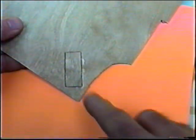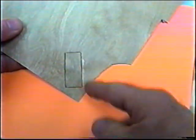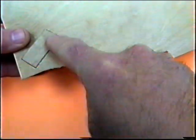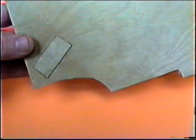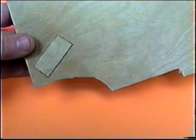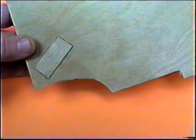Now the easiest way that I like to laminate the plywood is with the grain of each one going in a different direction. Picture 4 different directions. And then each time, once the pattern is made, cut out the part and lay it on with the grain going in the opposite direction. This way you really maximize the strength. You're making a part that's really lightweight and really durable at the same time. If you make this part out of plywood that only has 3 or 4 grain directions, it's not going to be as strong as this, and it's going to be heavier.